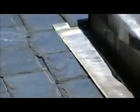Underneath here, the metal flange is all open here. Needs to be adhered better to the roof line. All the way along here. All flashings on side seem to be lifted a little bit. I'm not really sure where it's coming in. Could be coming in a few areas.